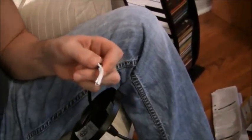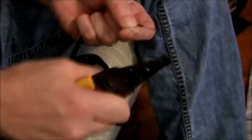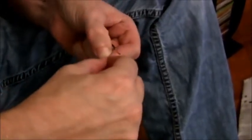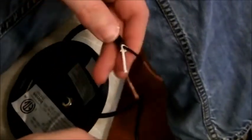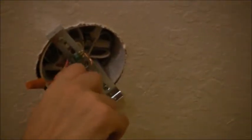Now I'm removing the rubber insulation and exposing the two wires. I'll strip the insulation off the wires, wind them up, and now we're ready to hang it up. Attaching the white to the white using wire nuts — the copper and black are already done. I'll put all these wires back in the box, come back down the ladder, and attach the canopy to the bracket.